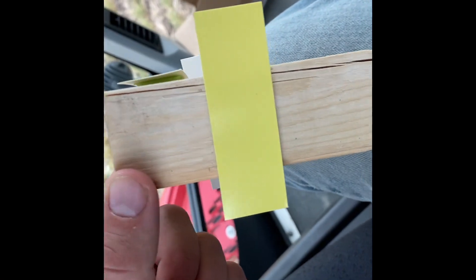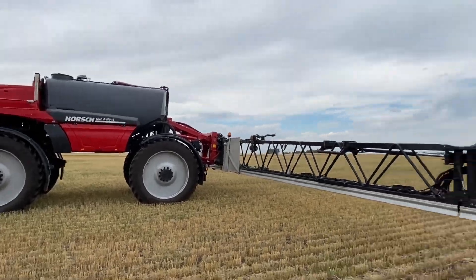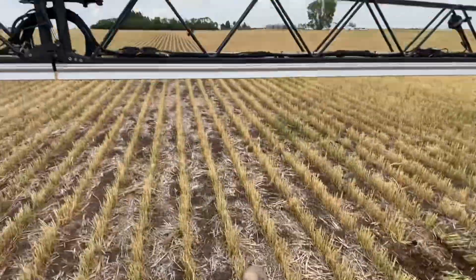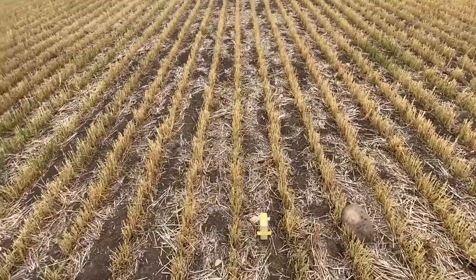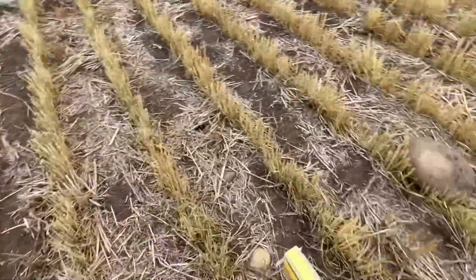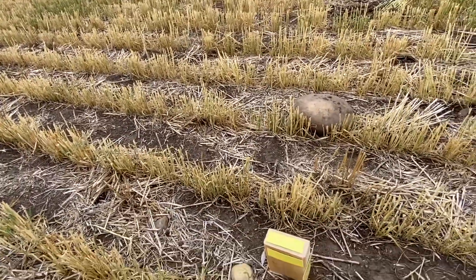The way this works, you got to put these on with little tweezers so you don't get your thumbprint on there, because it'll match your thumbprint and wreck our data. We're just setting up on our first pass here — I'm marking my spot with a big rock so I can put it back on the same spot at every pass. I'm going to spin around going down that way at 15 miles per hour over our target. I'm marking top, front, back, and side to side to get a full 360-degree view of what's happening as these droplets come out of the nozzle.